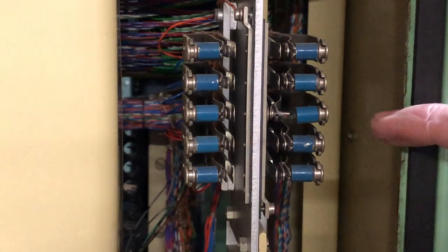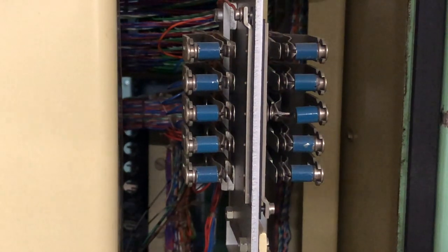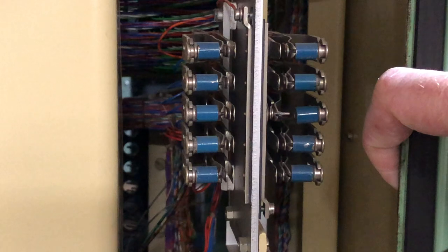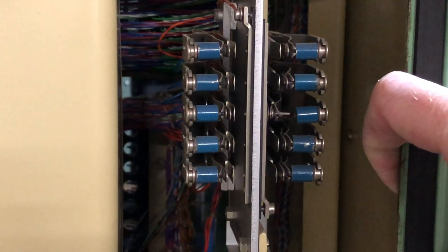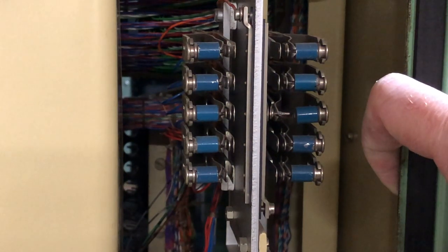I'm surprised nobody spotted this yet — I've had a heat coil blown for months, years, because I move slow. I can't remember what it's for; I think that's for the callback selector, which is something I'll get into one day. The wipers were jammed up in the banks and that caused the release magnet to get stuck on, which is why heat coils exist.